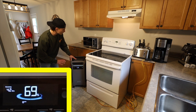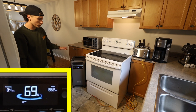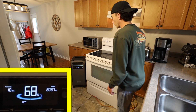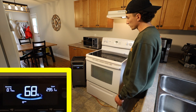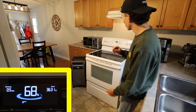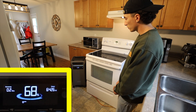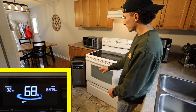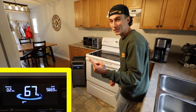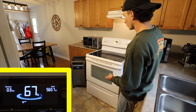Let's see realistically what we can get going in the kitchen without the oven and stove. We've got a microwave at 1,300 watts, one bagel toasting, coffee brewing, two bagels in — and we're just over halfway to the inverter limit, so there's actually a lot of room. Could you turn on one double burner? There's a big spike, but if you drop to just one toaster slot, you can run coffee, microwave, one burner, and one toaster slot simultaneously.